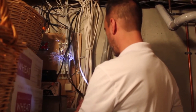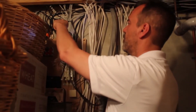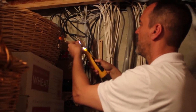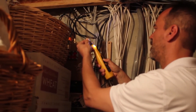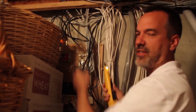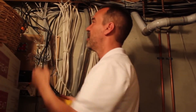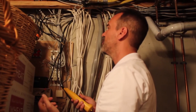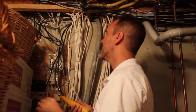I probe each cable — nothing, nothing — and a little signal over here. Not that one, not that one. That signal identifies the wall plate we're connected to upstairs. You label it, connect it, test it — now you know where it goes. The adapters make it easy to get the tone generator into the system.